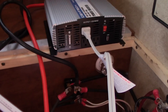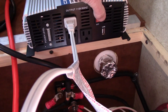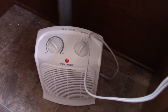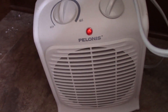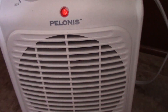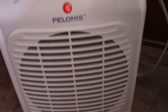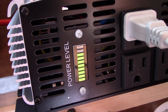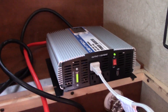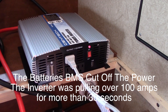One more little test — this 1,500 watt heater. I'll get it plugged into the inverter and click it on. The heater doesn't like that inverter either — you can hear it — but it did start. When we have a 1,500 watt load on, you can see the power indicator is down to almost two bars, and then it just tripped out for some reason.